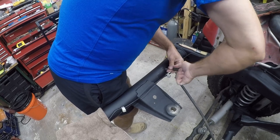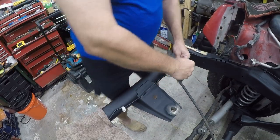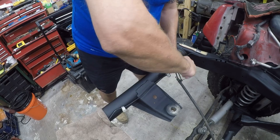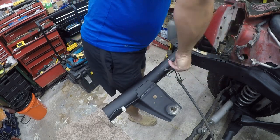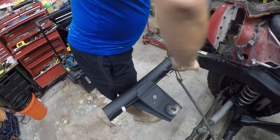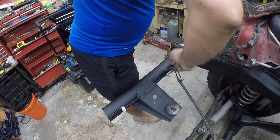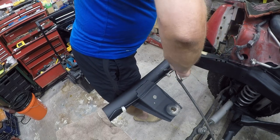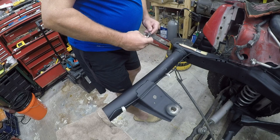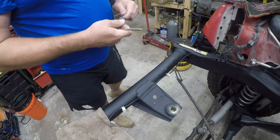And it just does not want to catch. It's 1/4-20. Huh, what do you know? The holes that are here are the right size. Screw it, I'm going to tap this hole then. Well, they're not quite the right size. This is a truly shitty tap wrench.